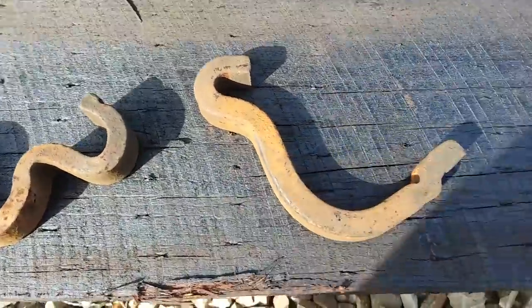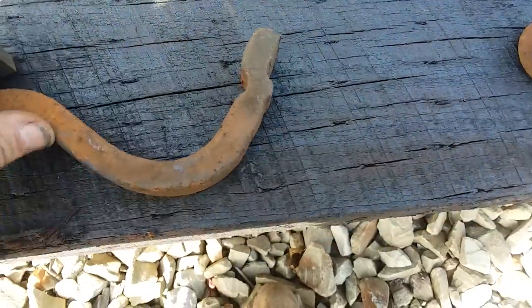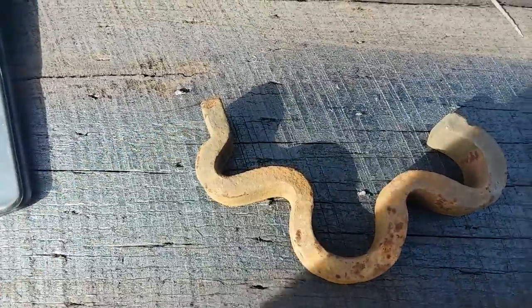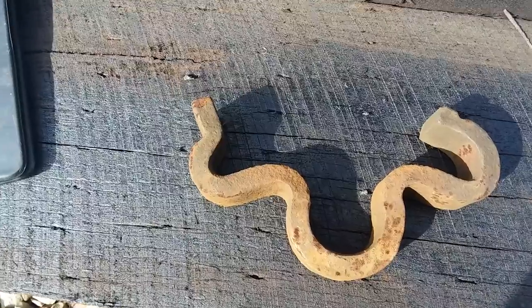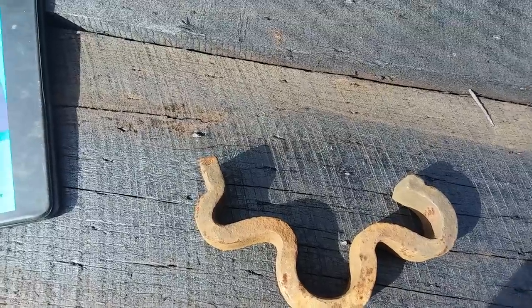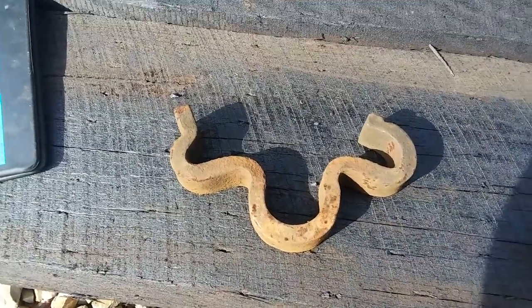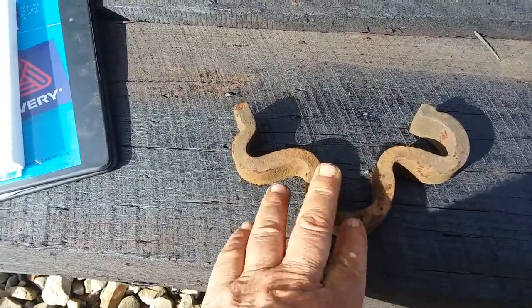These snap-ons, wrench-ons, or spring-type anchors — this is a drive-on type where you drive it on and then it snaps up over the base of the rail. This second type is called a Wooding anchor. Way back in the early 1910s, there was a company called the Woodings Railway Warning Device Company, started by Benjamin Wooding. I believe his company invented these types of anchors, which is why they're called Wooding anchors.